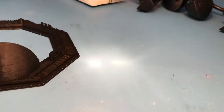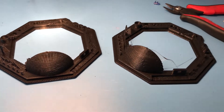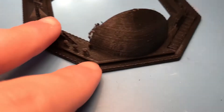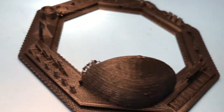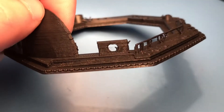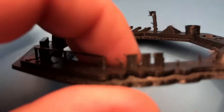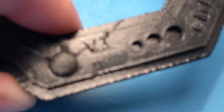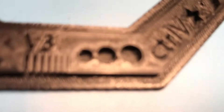Comparing with the old extruder: I have two prints from the old extruder — one from before the spring swap on the glass bed and one after. The one after looks better so I'll compare using that. There are some zits going on on the old extruder; there aren't any zits on the new one. The overhang print was fine but look at the amount of stringing going on. Surprisingly, some walls printed better with the old extruder, but everything else is better on the new one. The thin walls all merged with one another on the old extruder — they're very well separated on the new one.